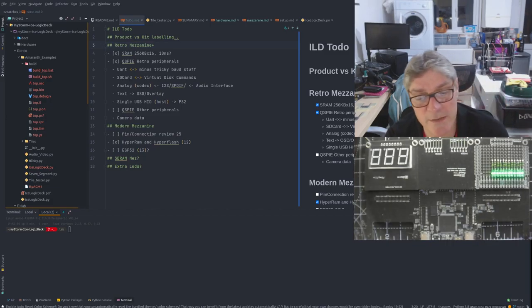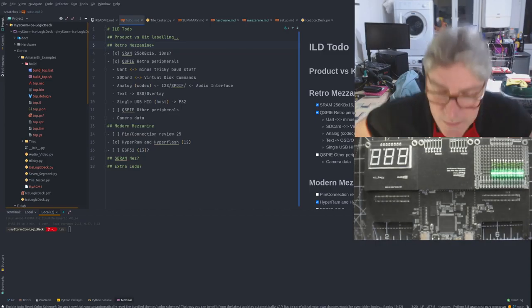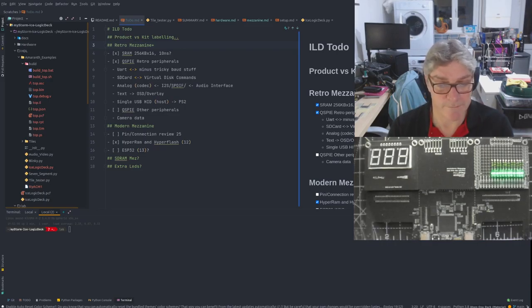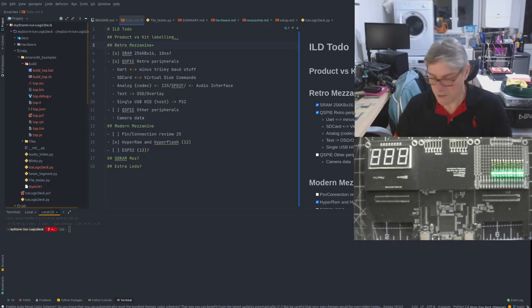Real-time clock. You've got a real-time clock in the STM32, don't forget. That's just a bit of code. Because I also include the 32 kilohertz clock for the real-time clock functions on the STM32. I don't just put the fast crystal on, I put the low-speed crystal on as well for the RTC. So we've already got that. But as you say, if we did use this for the extra pins, the whole nine yards, to use the Americanism, then what on earth are we going to do?